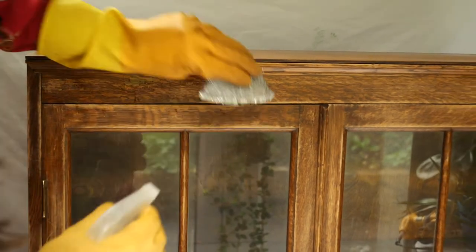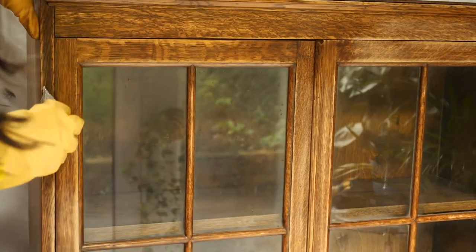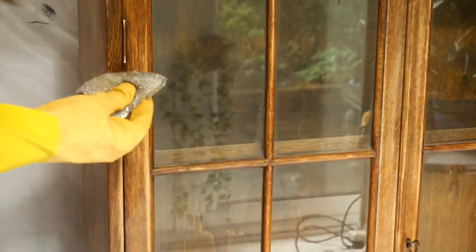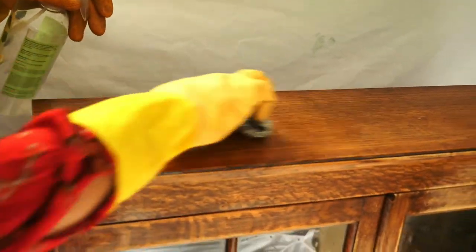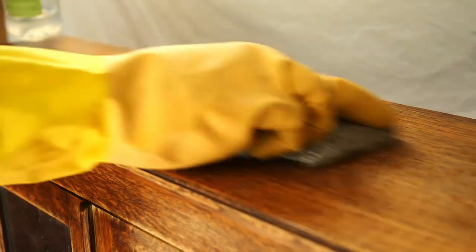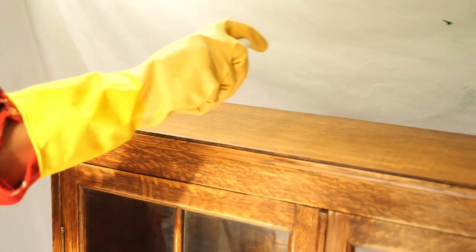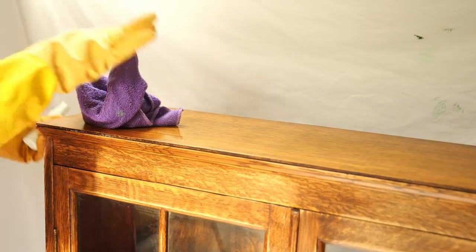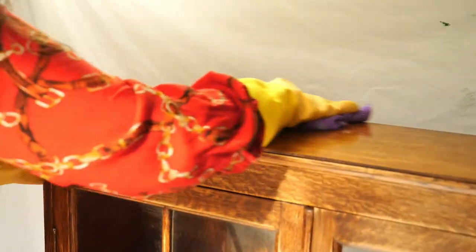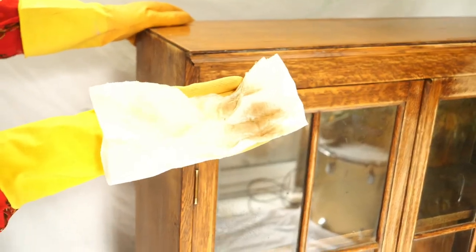better to the piece. Then I cleaned the whole piece with White Lightning Dixie Belle cleaner, using a wire sponge to give it a deep clean. Afterwards, I rinsed the solution just with water. I did it about 3-4 times to make sure every bit of dirt is off. After it dried, it was ready to paint.